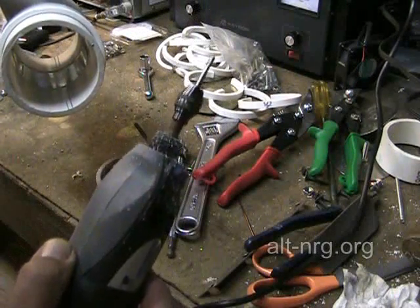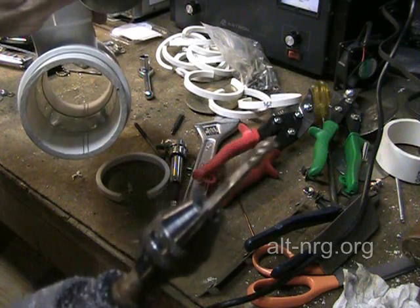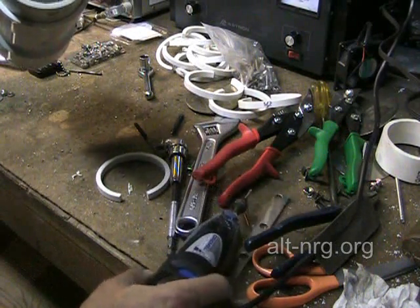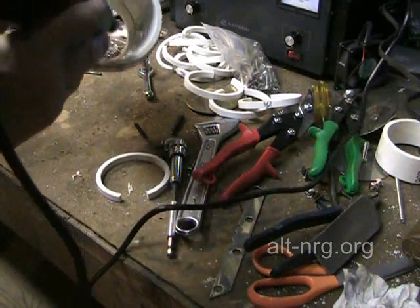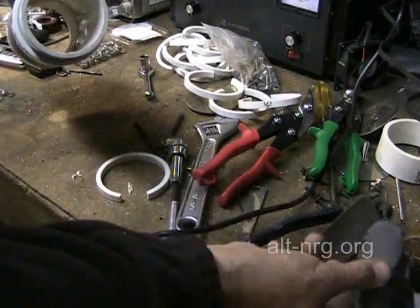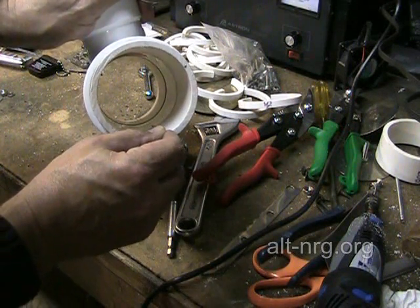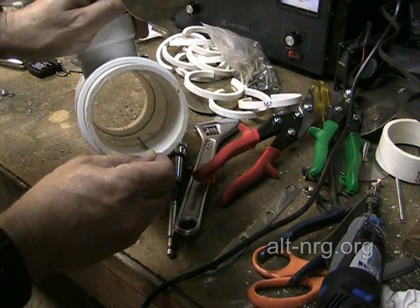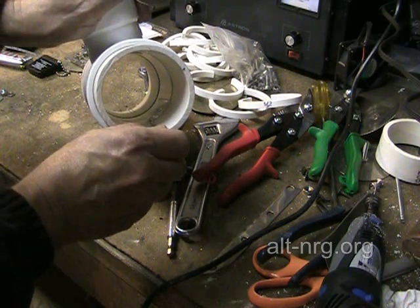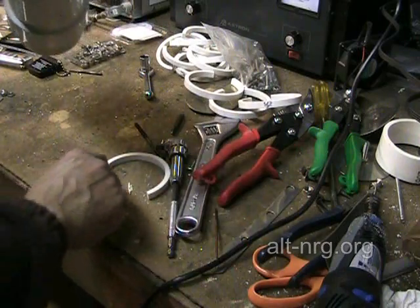I have a little milling bit that comes with the Dremel tool. I was playing around with a scrap piece and found I was able to create a channel very easily and evenly down inside. What I am going to do is, after I have created the channel and when I apply the adhesive, I am going to lay a piece of 12-gauge copper wire in the channel opening and allow the adhesive to cure. Once the adhesive has cured, I should be able to grab this with a pair of pliers and pull it back through, and that will create the channel underneath in between all of the plates.